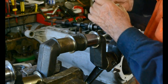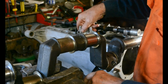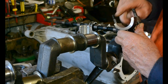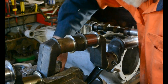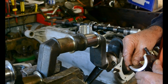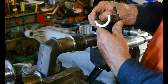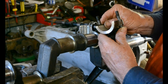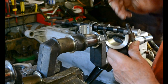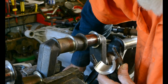There we are, we can clean that up. Put our shims back on again. There they are — you can peel one of those off, and you would take only one off. Now that's about a thou and a half in the old system thickness. So you would take one off and then try it. You don't have to take two off — just one. And you would probably find that would fit if it's too loose.